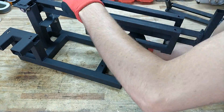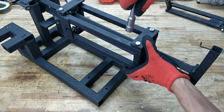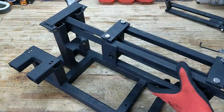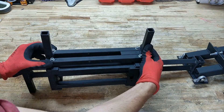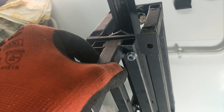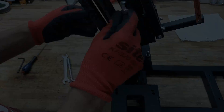The slider is positioned on the rail. Four screws allow me to precisely clamp down the bearings on the rail without any play. Because the screws shouldn't be over-tightened, these rubber pads push against them and prevent them from unscrewing. The blade holder is put together and then mounted on the slider with four screws. The holes are way bigger than the screws, which gives me some play to manually adjust the position and angle of the blade to ensure a perfectly square cut.